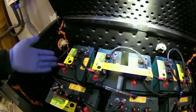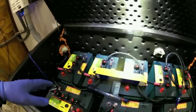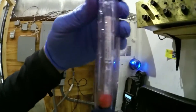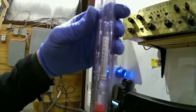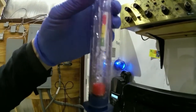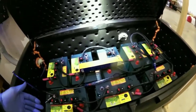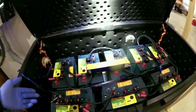Your battery manual will tell you what specific gravity should be based on the battery manufacturer, but it's usually around 1.27. The hydrometer shows the values and indicates that your good range is 1.26 to 1.30. You need to make sure your battery bank is reading full charge before testing, because if you test specific gravity when the battery is low, it's obviously not going to read full.